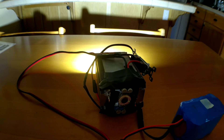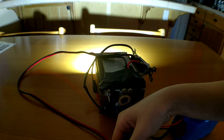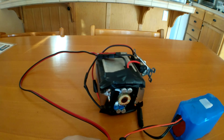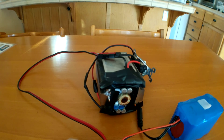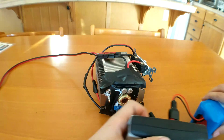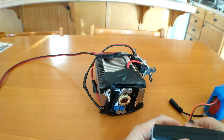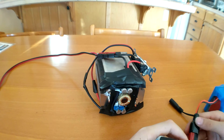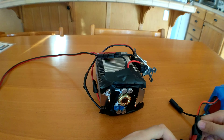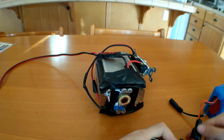This is a project I worked on today. I'm not sure how much the heatsink would cost. The switch probably costs like $5. The LED itself costs me about $4, as I said. And that little 250-watt boost converter, which is current limiting, is not actually running at 250 watts — it's probably only running about 100 watts, because that's the rating of the LED. It's about $6 with $2.50 shipping.